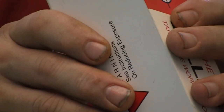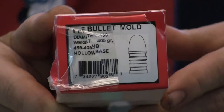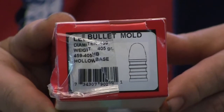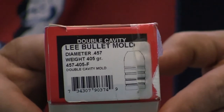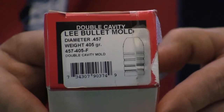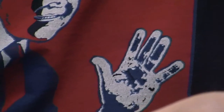Lee also makes an original — the 405-grain bullet hollow base. That's the mold right there. A lot of people use this mold; it is an exact identical copy of what the original bullet was, in the proper diameter of .459, used with black powder. Now when you get into some other molds, like this 457 mold by Lee — this is for a 4570 but a more modern one. It does not have the wide grease grooves for black powder; it's good for smokeless, but it is still too small in diameter. Not good for a trapdoor — it's going to cause leading.